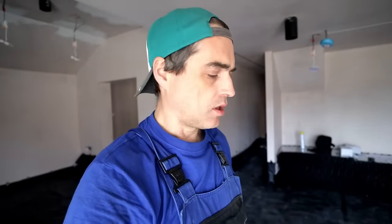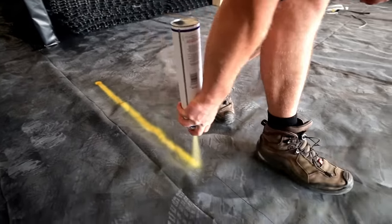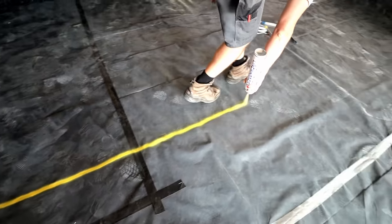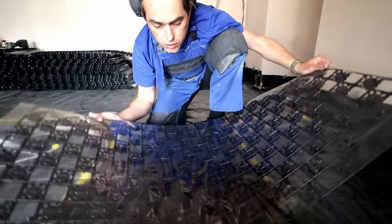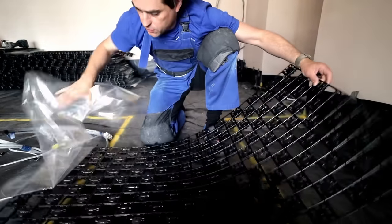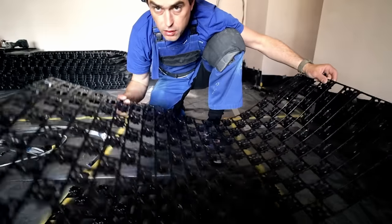The reason for not sticking straight to the insulation is that liquid screeds apparently react with insulation and eat through it, so the insulation has to be protected from the chemicals within the screed. If you were doing a dry mix traditional screed, it's fine to put it straight on top of the insulation. The way those panels get installed — you pull the film out, there are little blobs of adhesive on the back.